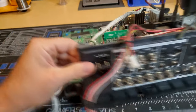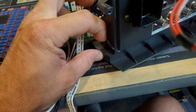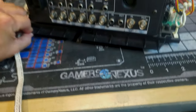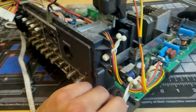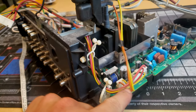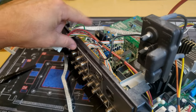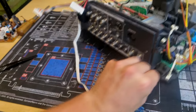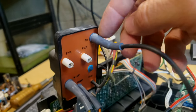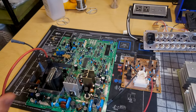Next we get the input board out of the way. There are little flexible plastic tabs — you pull those out and push up to free the board from the shell. Make sure to disconnect the cable points on this side and the back side of the main board. The last thing is disconnecting the black cable from the flyback to this portion.